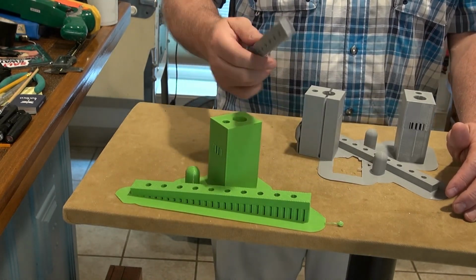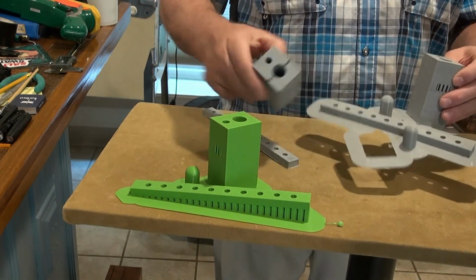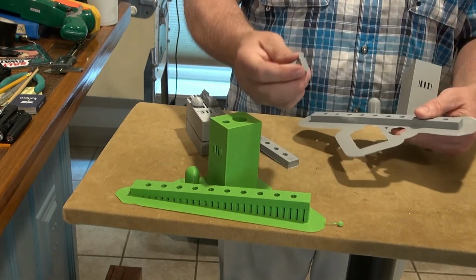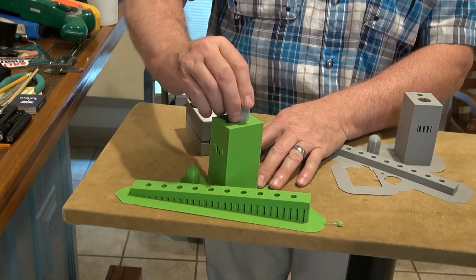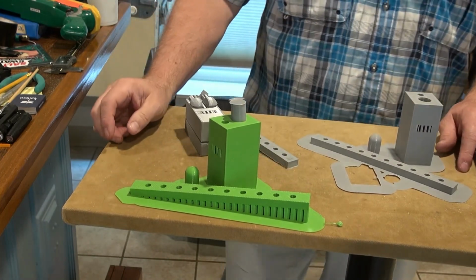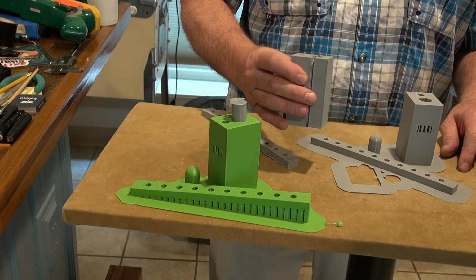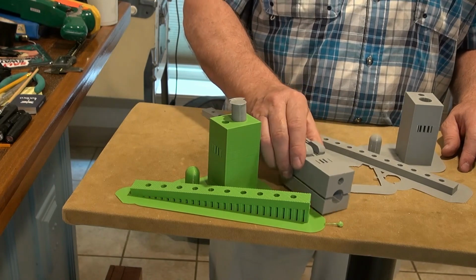And the magazines, of course, they sometimes get a warp on them depending on the heat. This one probably also slightly warped. And then here's the indent follower. The scale is not quite right. It's a little too tight to work in here. So I need to adjust the scales of the parts. There's quite a bit of variance in the actual dimensions of the part versus the design, and it's generally because of the orientation of the print.